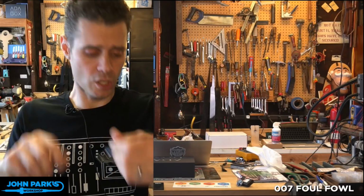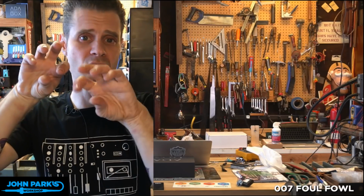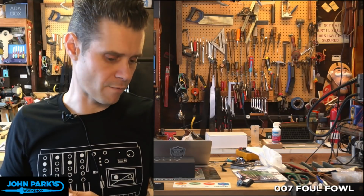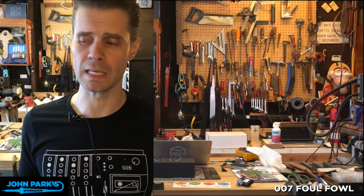But anyway, you could do some interesting things with, if you want to make an Etch-a-Sketch, you can have your mouse X and mouse Y based on that. Very simple stuff that you can do, all based on the power of the M0 chipset and its ability to be a keyboard or a mouse, and the CircuitPython HID libraries make that really easy to use.